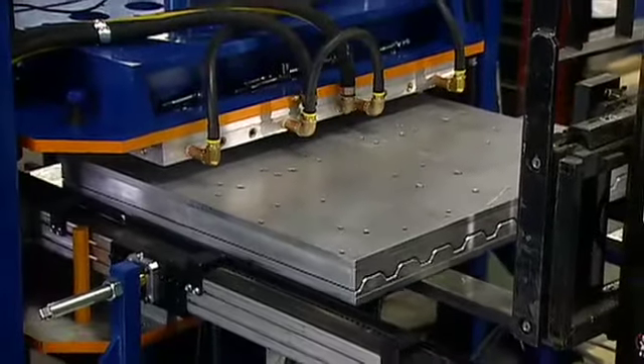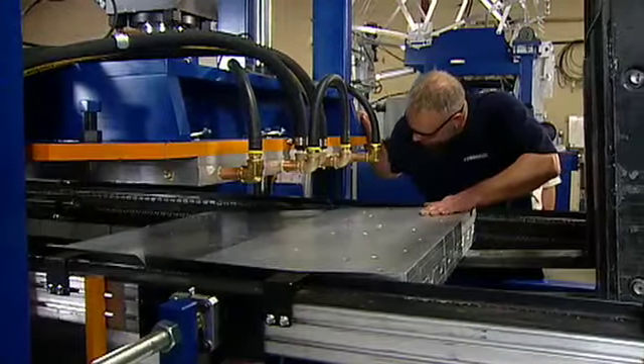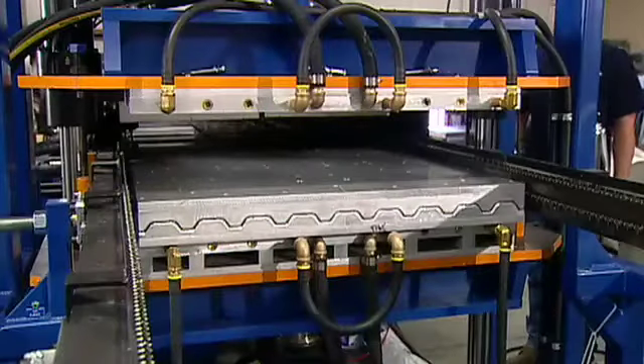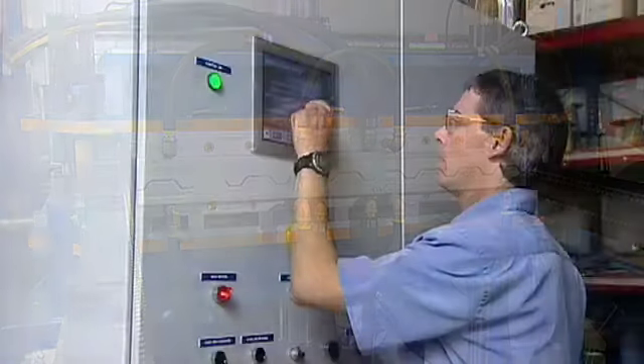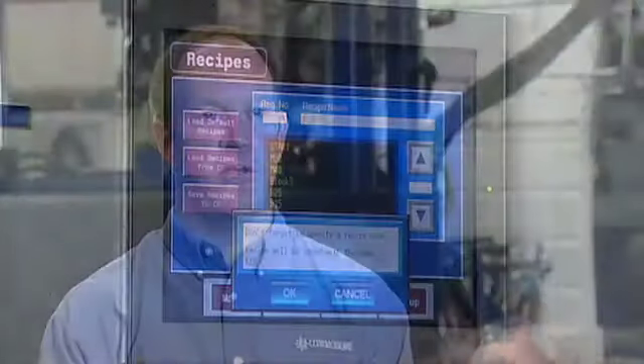On this particular machine, we have a common set of cooling plates that stays in the machine. When you want to change between items, the tool changes faster because you're not having to reconnect all the plumbing. You unbolt the mold, slide it out, slide a new one in, and it comes right up to a pin that locates it in position. You put the bolts in and you're running. In terms of cost, if you have 10 molds, you can make one set of cooling plates instead of 10 — there are significant savings to be had. Once you create a recipe for a certain item, you store it, and the next time you run that item it goes right back to how you were running it. The idea is fast tool change in the least amount of time, always starting from the same baseline condition.